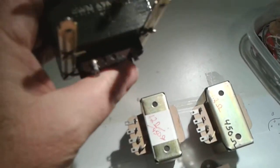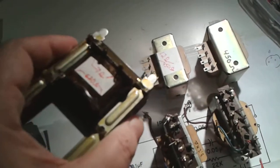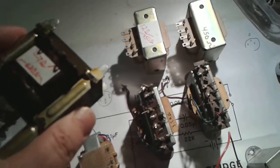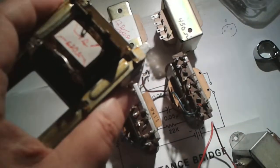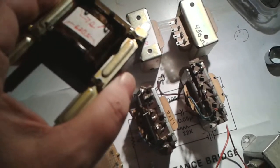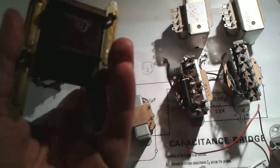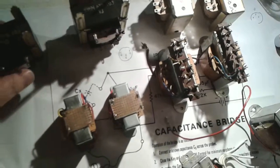Then there are these two here as well, which also might be TV transformers — I'm not sure. I can't see any writing that tells me specifically their ratings, but their resistance is similar to the others, a little higher. The smaller winding is 7 ohms and then 620 ohms on the larger, which would indicate it should work for a tube amplifier. There's a number on the bottom: 9WN 67610.1, so I might look that up.